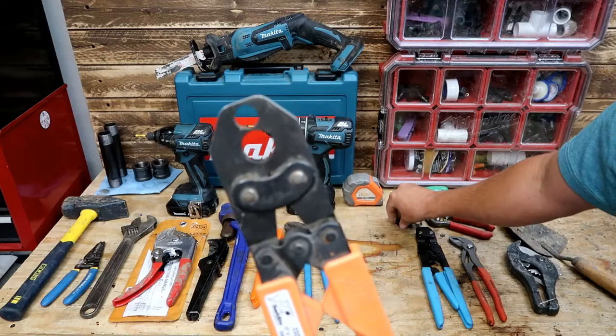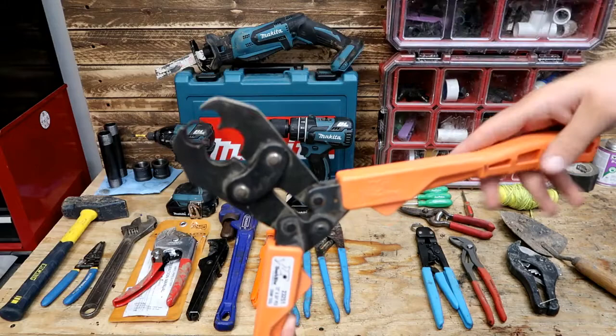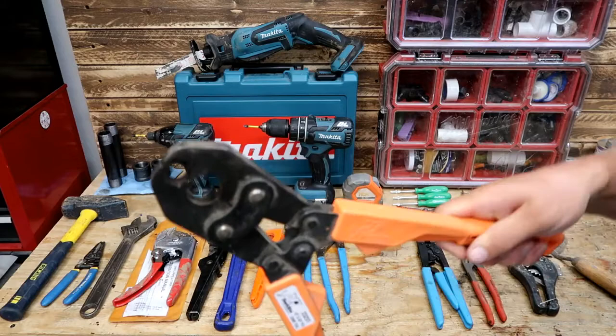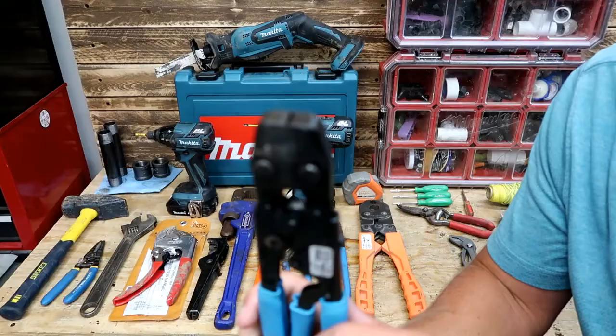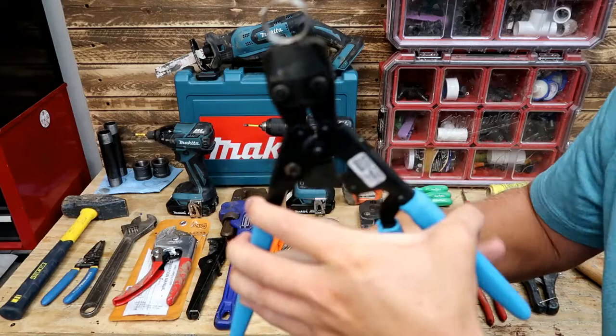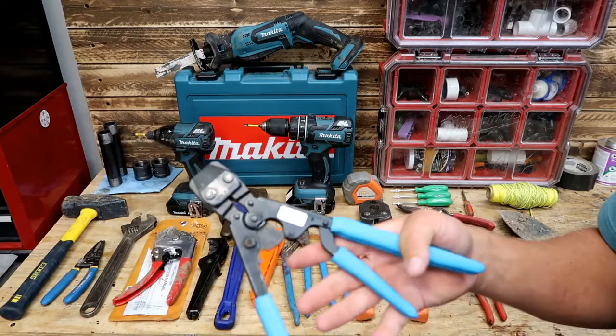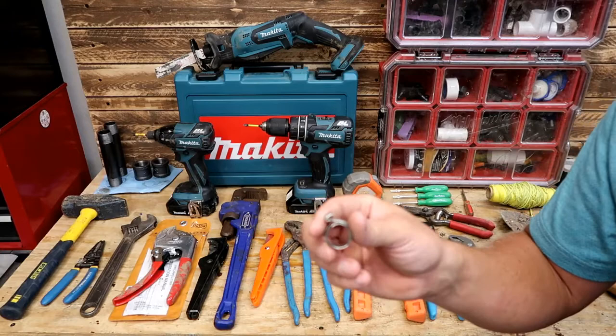Next up, we've got our specialty tools. We've got this SharkBite brand crimp tool. If you've got crimp ring-style fittings, these are for half-inch household plumbing. You set these inside, and when it crimps on the pipe, that's strong enough to hold the pipe onto the coupler — that's how you seal those. We've also got this band style where you take this specialty tool, it opens up on the end with a ratchet-style system. You insert the crimp end inside, put it around the pipe, and press it closed to crimp it. I don't use these as often, but when doing repairs I'll frequently find a system that has PEX or poly pipe.